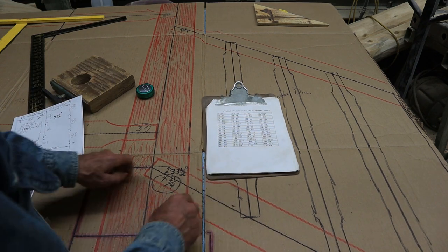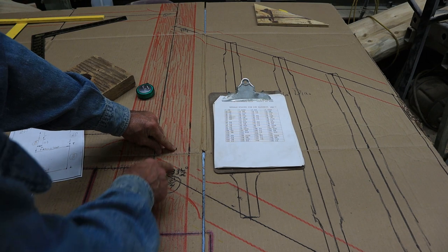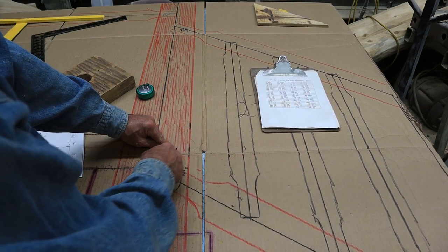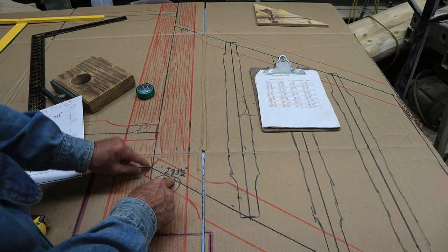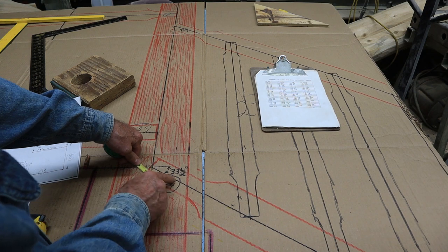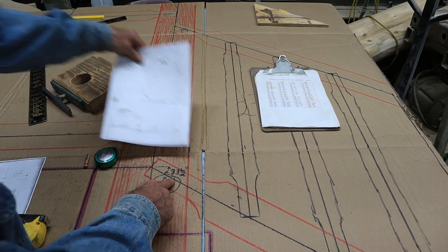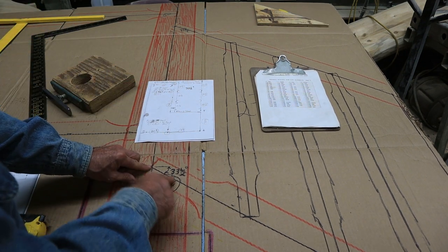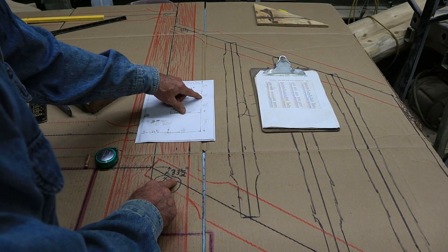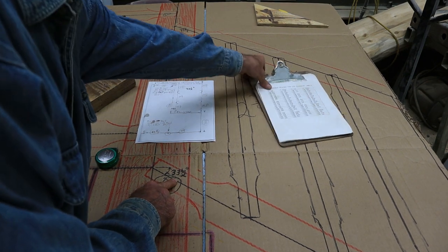So if we take and go, all right, the depth of here would be the imaginary line right here of the center. If there was a spindle right here, from here to here, because we had 6 3/4 from the middle to the middle to the middle, 6 3/4. So when you come back here to this point, from this point coming back, oh, here's almost 3 inches of tenon back here that we're going to have to subtract. So if we take the number of our handrail at 50 3/4 and take 3 off of each end, so we can get equal spacing between them, we take 3 off of each end and go, okay, it isn't 50 anymore. If we go 50 3/4 minus 6, then it would be, oh, let's say 45.